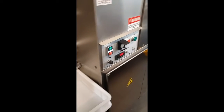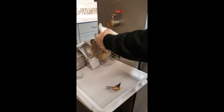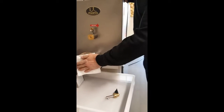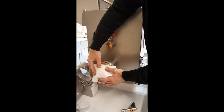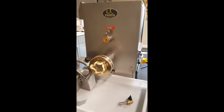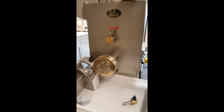and a note, when I mentioned that after you receive the die and you use it for the first time, the second time and on will be coming back from the water bath. So what you want to do, you turn the extruder on, use a paper towel to capture all the product left behind in the die, which is going to be cleansed, you can see it pushing through, and we wipe it, stop the machine, and now we can start. Okay, clean.